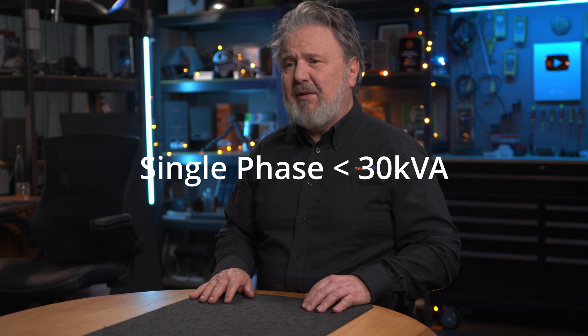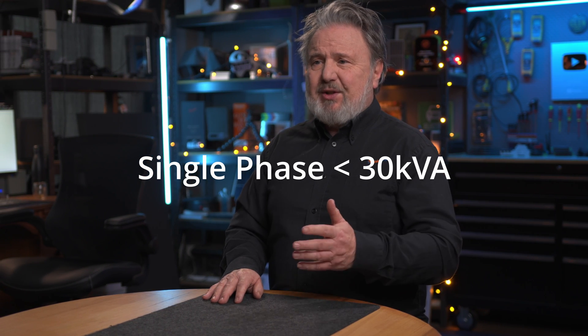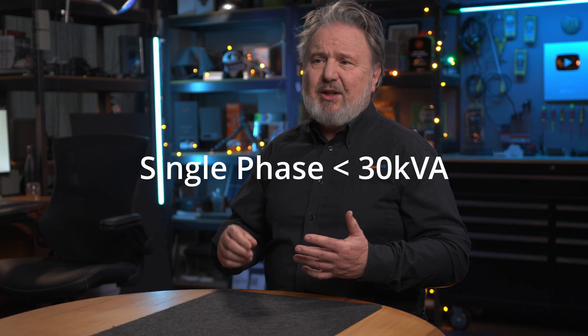What's next? Phase balance update — a little bit of change here. We now have a maximum of 30 kVA for a single phase installation. It's the lesser of the grid supply capacity or overcurrent protection for that installation, but 30 kVA max for single phase installations. Big news for those doing commercial industrial installations.